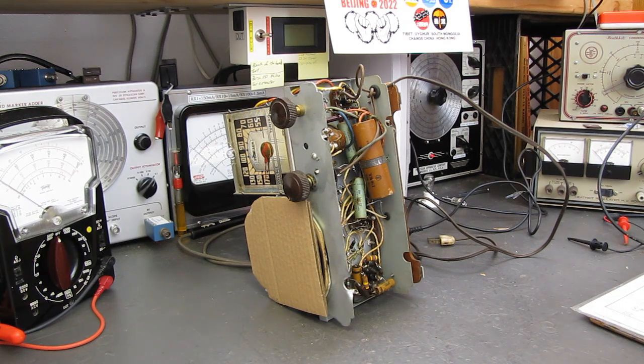I have done that. I often do it when I'm not doing a video. I can go in and shotgun the capacitors. However, I've been burned once. I've got a receiver downstairs that I went through. It's an early AM/FM set, and I went through and changed all the capacitors, only to find out that somebody had been in there before me and some of the RF coils in the front end were missing, and he had made this kludge out of resistors and capacitors to try to get it going. The set works, but it's as deaf as a stump because the RF amplifier in the front end isn't working, and there's no information on what the coils are. I can't reproduce it. The only thing I can do is someday hopefully get my hands on another set and copy what's in there.